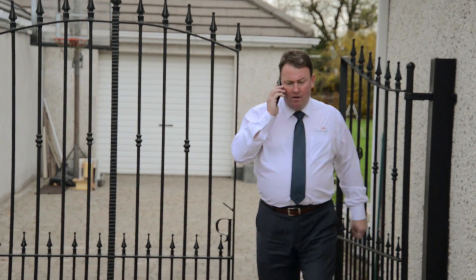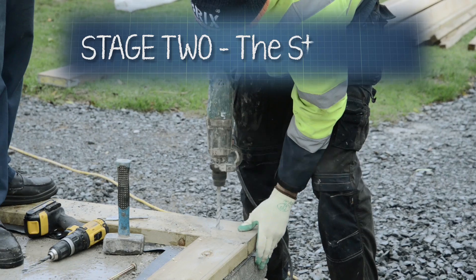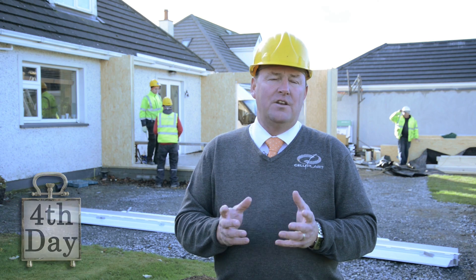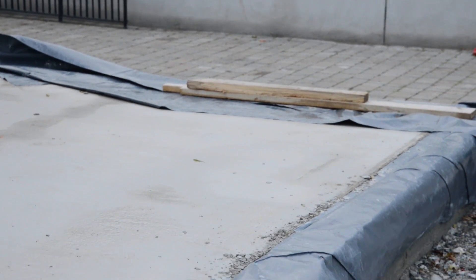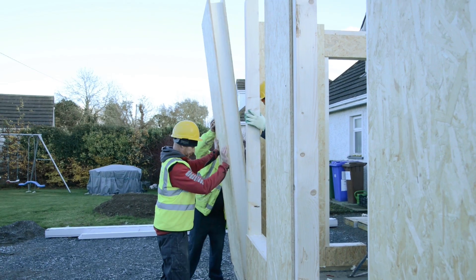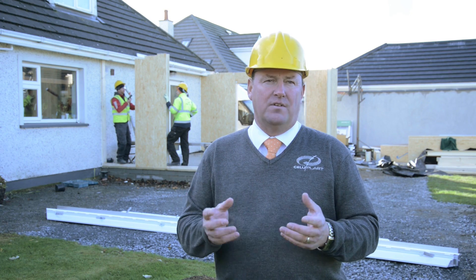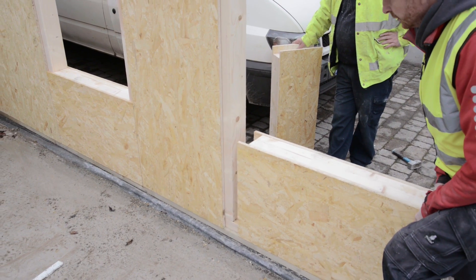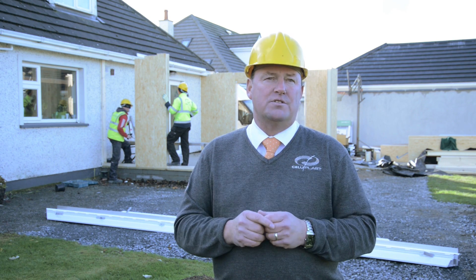Like any traditional build, the foundation is the very same — a concrete slab and rising walls, no different than any other extension. The only difference happens when we get to the tech panels. So far today, we've got our sole plate on, which is really the start of construction after the slab goes in. Once we have our sole plate on, we can put our bottom plate on, which receives our tech panels. Our tech panels then, more or less Lego-like, go around the building. Once we have them in and sealed, we can then work on our superstructure for the roof.